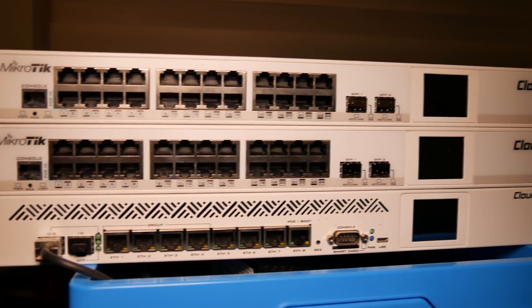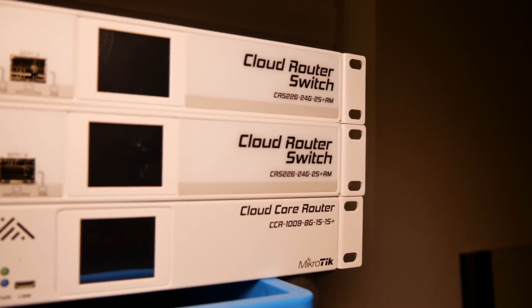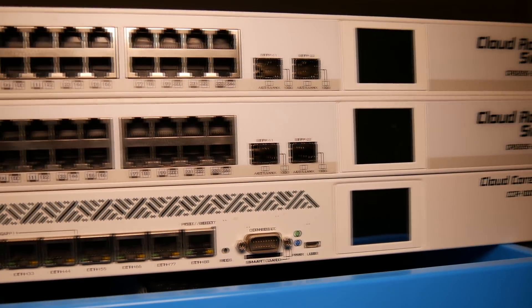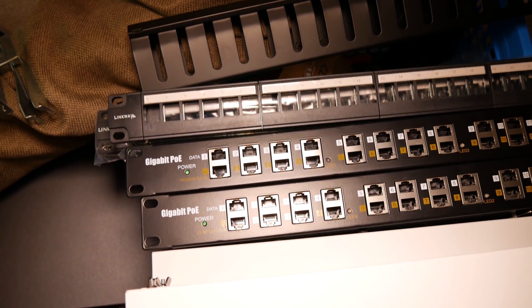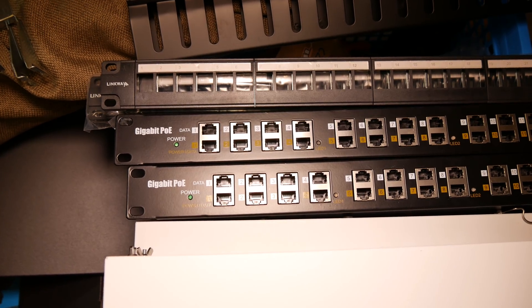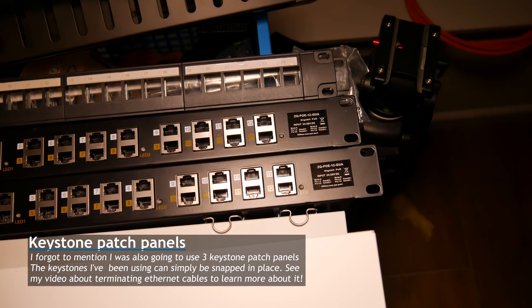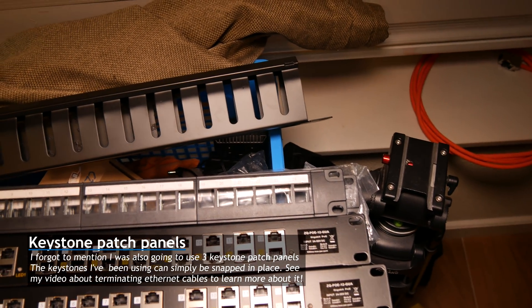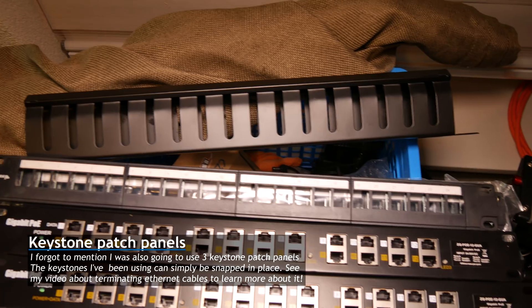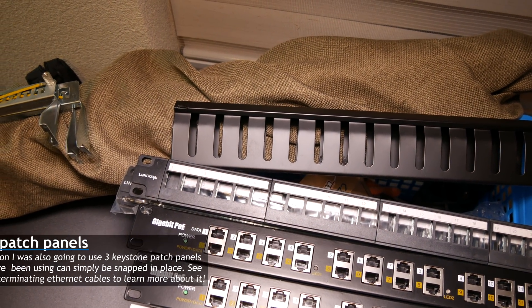Next to the patching panels, this is all the equipment that is going to go into the rack. Here is the router and the switches I talked about in my previous video. Behind that we see two power injector panels — I ended up using only one. These are different from the PoE switch I showed previously: you basically input a data wire and it injects power onto that wire, giving you a wire with both power and data. I used these to feed my access points and security cameras, and in the back you can see some wire arrangement panels to try and make everything look nice and neat.